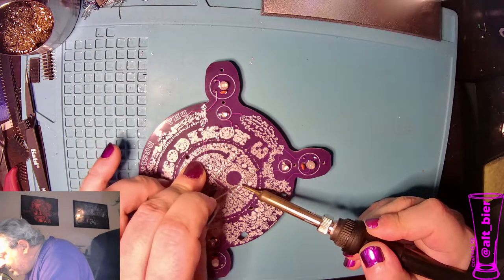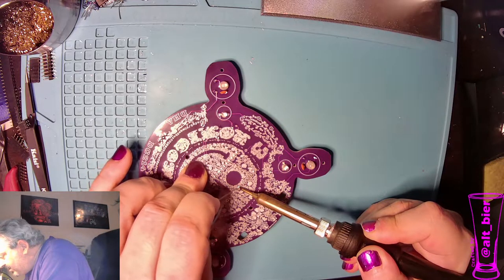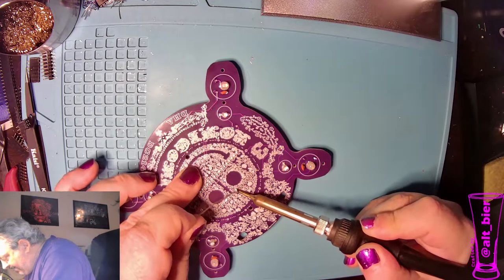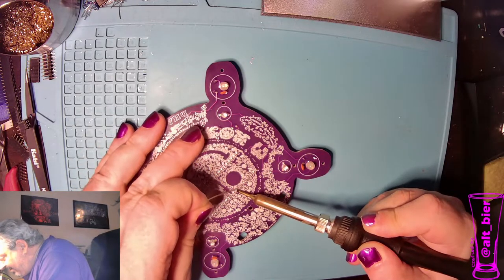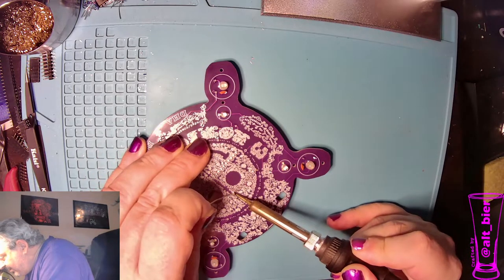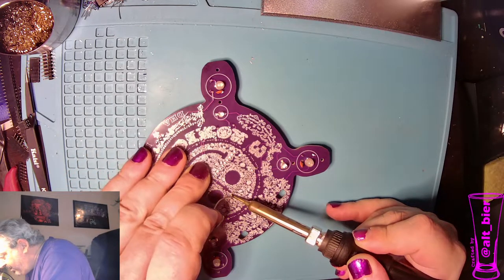Even though there's just this little nub sticking out, it's still that thick header pin, and so we still have to wait a second for it to heat up before the solder starts to stick to it. And those header pins are very thick. They are actually very time consuming to trim if we did need to trim it. That's another reason other than aesthetics to not want to trim these pins, because it's a pain in the ass to cut them all, especially when you're dealing with 20 on each side. That's 40 pins to cut. No thank you if I can avoid it.